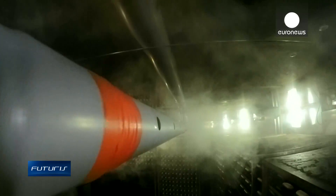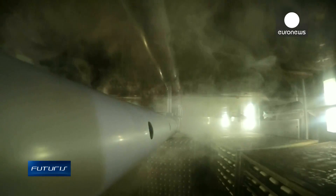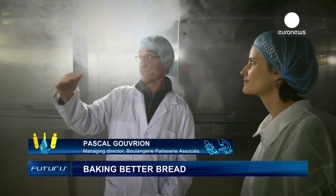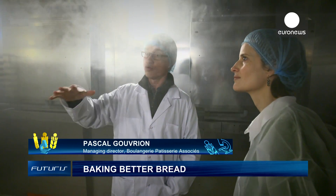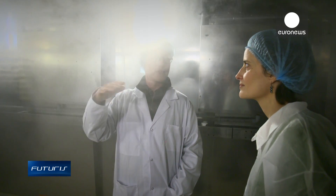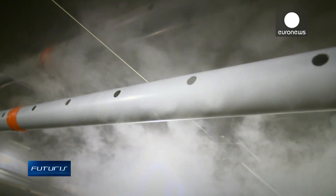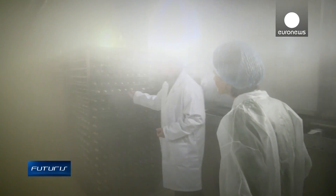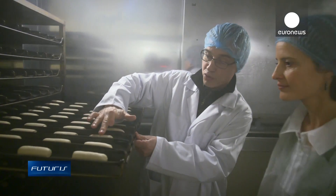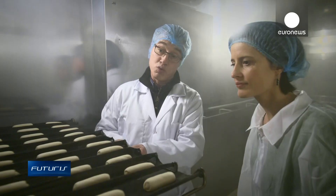Here we are in the controlled fermentation chamber. You can see this nano-mist, which is distributed throughout the room's atmosphere. We are able to generate high humidity, sufficient, in the order of 80%. The atmosphere is pretty cool, because our process is precisely based on a low temperature fermentation. There isn't an excessive moisture on the product – it can be tested by touching it, which is a standard test in baking. We see something that is not dry, nor too wet, which is really what we are looking for in this fermentation phase.